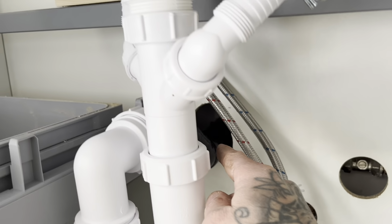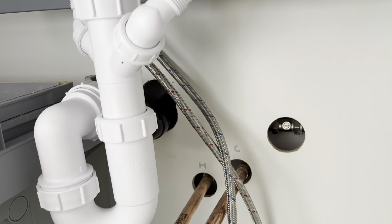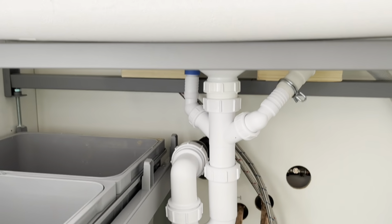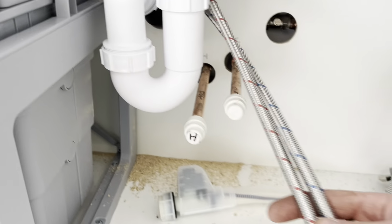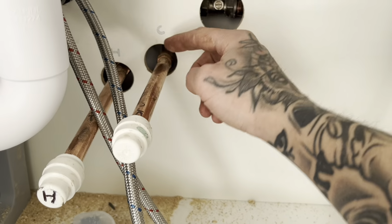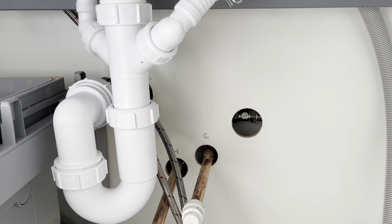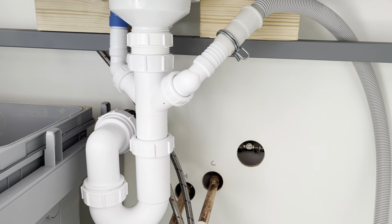Don't even ask. Pilot bit must have found a joint, so when I've drilled it from outside in, it's still out. I wanted to leave tolerance on this, in case this sink has to move up or down. Obviously this is an adjustable trap. You see the size of flexes on this. Look at that on this temporary tap. I'm just going to come off here, a bit of tee for the dishwasher, the hot straight up to an isolation valve. Not finished the waste outside yet, but that's where we're up to now.